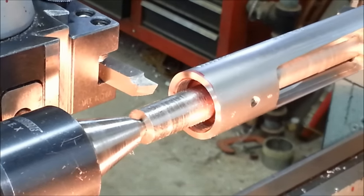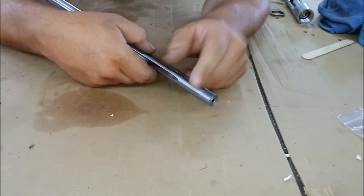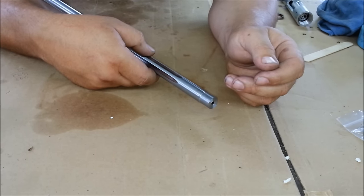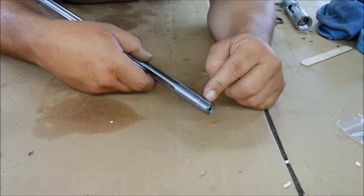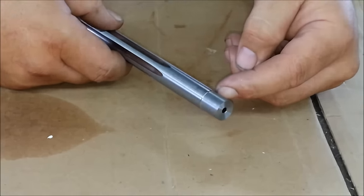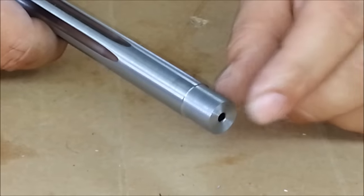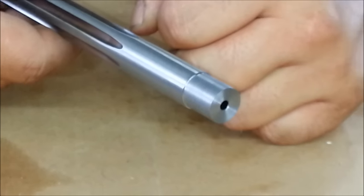There we go. Now everything's pointed in the same direction. Beautiful. Okay, so what we're going to do here is set up a barrel to thread and chamber it. First thing I do is get out here on the muzzle end. I cut it off within an inch of where the crown's going to be. That way I have a spot that I can turn concentric to the bore line to hold on to for all my other machining work, so I actually have a hold of it.